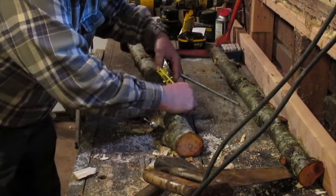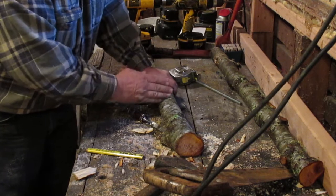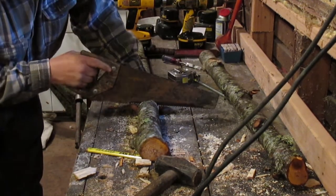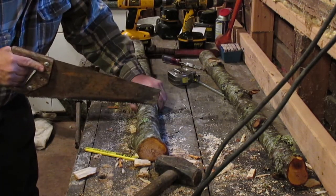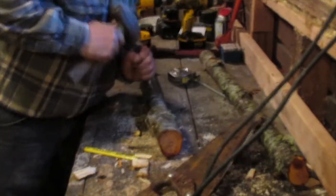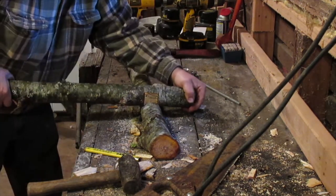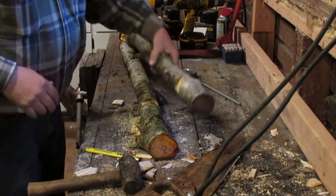Let's see how that worked out — that is an inch and a half. So now I've got to cut with my saw down in here. You really don't want to use a power saw on this because you'll cut too far and get it in the wrong place. A hand saw gives you just a little more control. It's pretty close, so let's chisel that out.